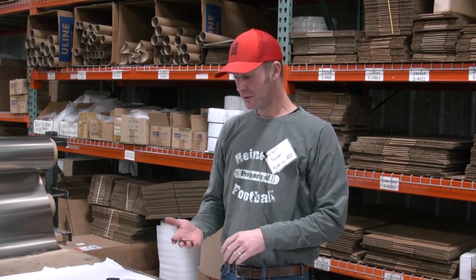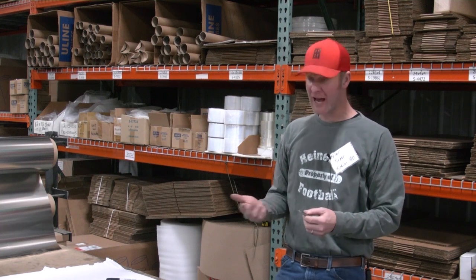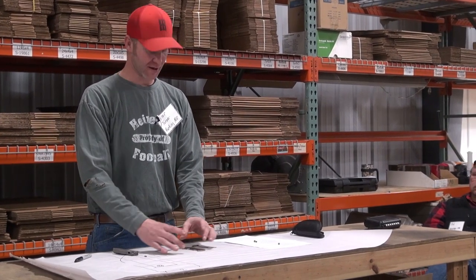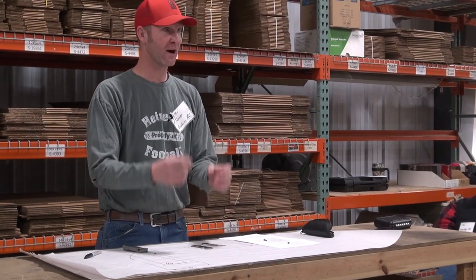Right. That's interesting. But then, if you get into doing liner locks and stuff like that, I have a mirror jig. So I can put both frames up here, or when doing bolster locks, I can put both frames right there, and I've got locating pins all over, and they're tapered.